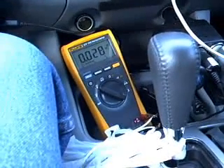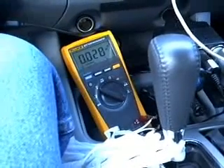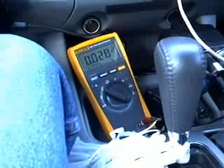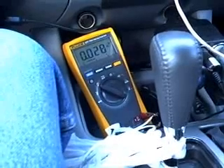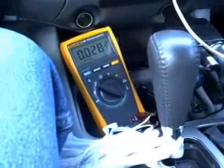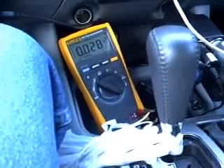This is where the pulse width modulation circuit is going to come into play. As the cell warms up, the conductivity increases, meaning the resistance decreases and the amount of current the cell wants to draw goes up. The pulse width modulator circuit will sense that current change and decrease the duty cycle going to the cell. So the pulse current will increase, but the RMS value will decrease.